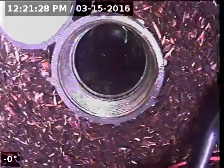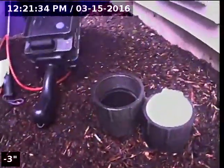Good afternoon. I'm Jeff with Sewer Tech Northwest. Today we're at property address 2588 North Joseph Street here in Cornelius. We're located at the left side of the home. We've got a three-inch ABS clean out, just on the front yard side of the fence here. This will be the point of access. I'm going to insert the camera and check the overall condition and serviceability of the sanitary sewer line.